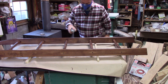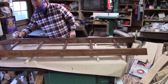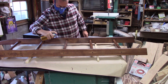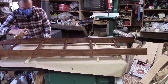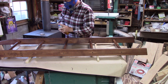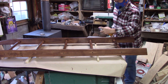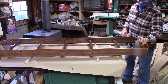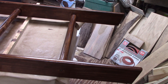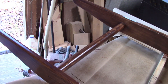It worked out really well. I'll do three coats of this satin polyurethane, sanding at 320 between each coat, and this thing will be ready to go. Once it's cured up, it'll be good to go. Just remember, you have to sand in between each coat with polyurethane, but it gives a rock-hard finish and it'll last practically forever — it's a very good finish for woodwork. And here it is after the third coat. I think it's looking pretty good, and we're almost done — we just gotta let it cure.